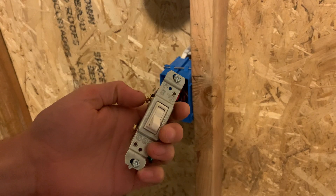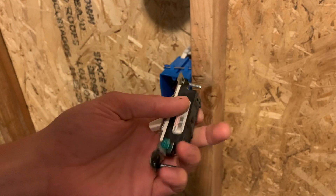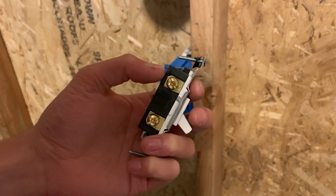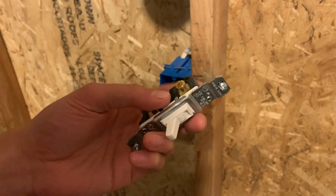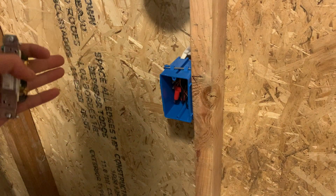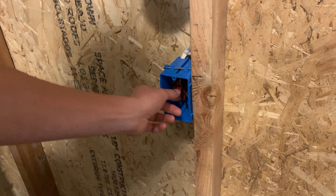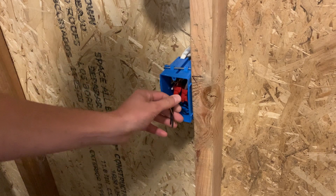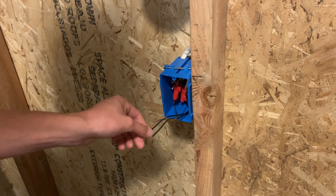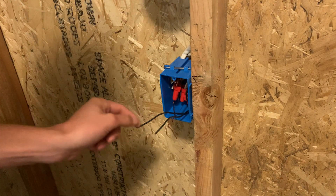I did remove the ears on this before. But anyways, I just want to show you guys how to install this real quick. It's got three screws: one for ground and two for the switch leg and the hot wire. This is from a long time ago, the switch box that I made up. So if you're watching these videos in order, it's going to make sense. But if you're just watching this video today and tuning in for the first time, it may not make sense. I've got my ground wire here pigtailed, and then I have my hot wire pigtailed and my switch leg.